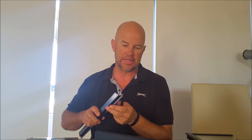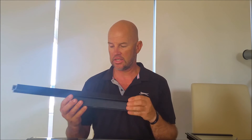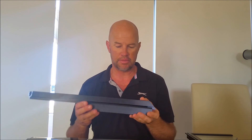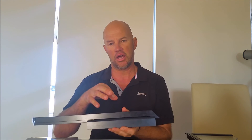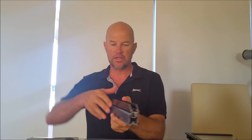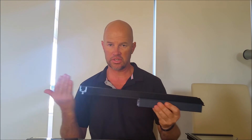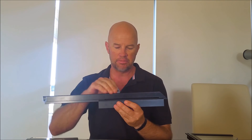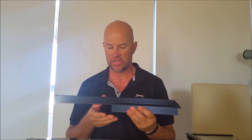We've got many different adapters, so we have different profiles and different positions for the legs. This allows us to accommodate the channel and set it for the frame. We need to do that sometimes to make sure that your windows will operate exactly as they did in the first place. We're now carrying a much wider unit, still within the thickness of your frame. For example, if we have sliding doors they still need to operate and not jam, so by using different offsets we can set that up so that everything functions as it originally did.